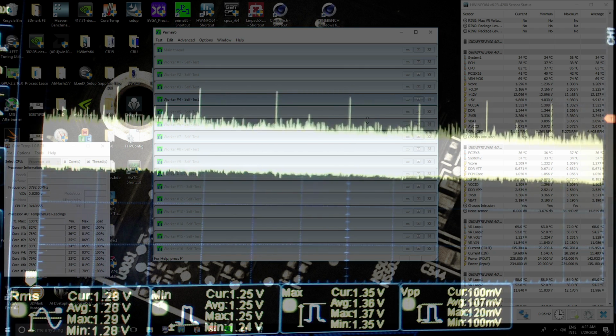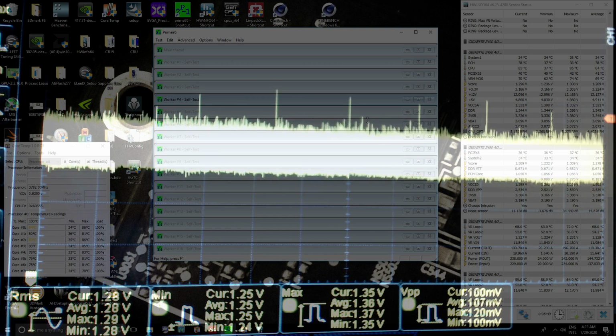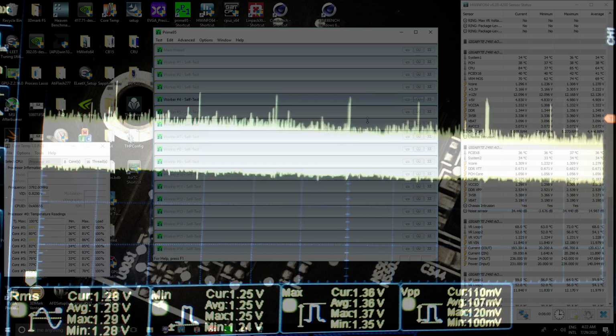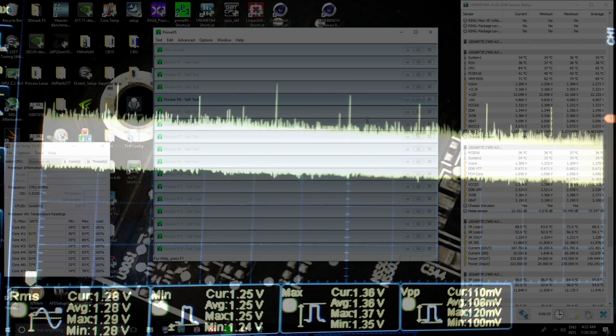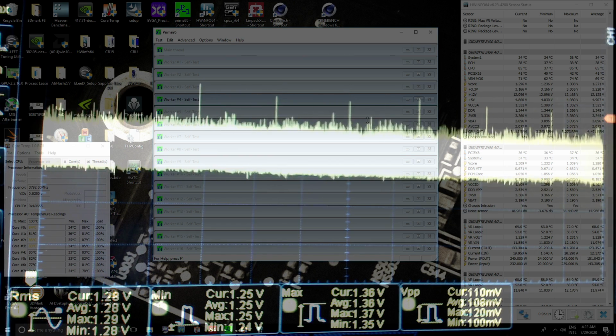And that is basically a spike of activity on the CPU. It runs a bunch of instructions, so the CPU pulls a bunch of power, and we get that voltage spike downwards, because suddenly the CPU pulls in a bunch of current when previously it wasn't pulling anything. Now, when we're running Prime 95, we're pulling 200 amps constantly until the Windows timer goes, hey, stop running Prime 95, and we get that upward spike. Because it stalls out the workload, suddenly all of that current going into the CPU has nowhere to go, and it translates into that upwards voltage spike.